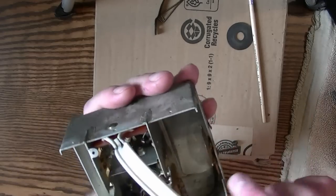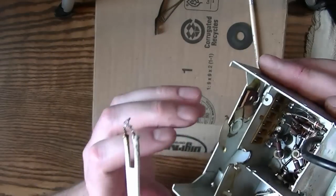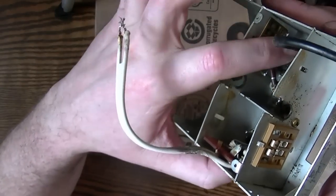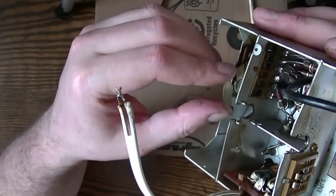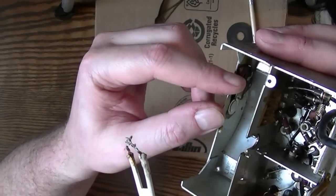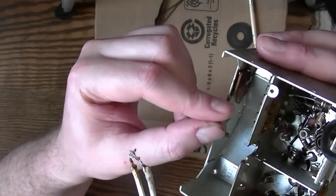So I guess this is what actually forms the capacitor down in here. There is a metal plate with a wire going to it that runs over into here, and then this moves back and forth. So a very small, maybe fractional picofarad into several picofarads as that moves.